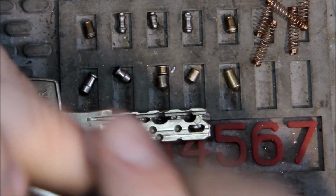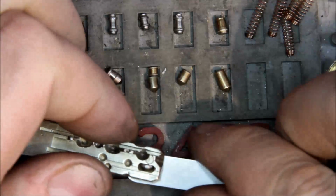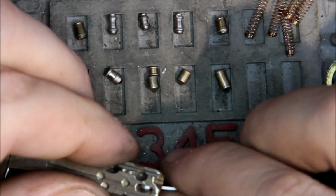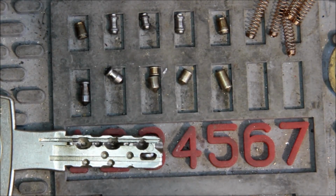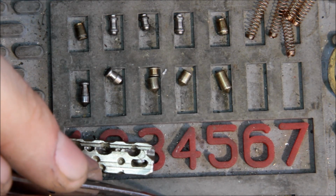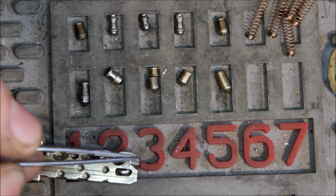And then, underneath, there is the Saturn ring. So you can see that moves. I'm not doing a good job of pressing it up, but that pops up when it's appropriately jiggled. There we go. And that rides on a ward. That, my very adept description of that, pushes up on this pin, and you can see it's a little bit pointy on the end. Okay, and we'll show you what that point does in a minute. Okay, and that's the active element.